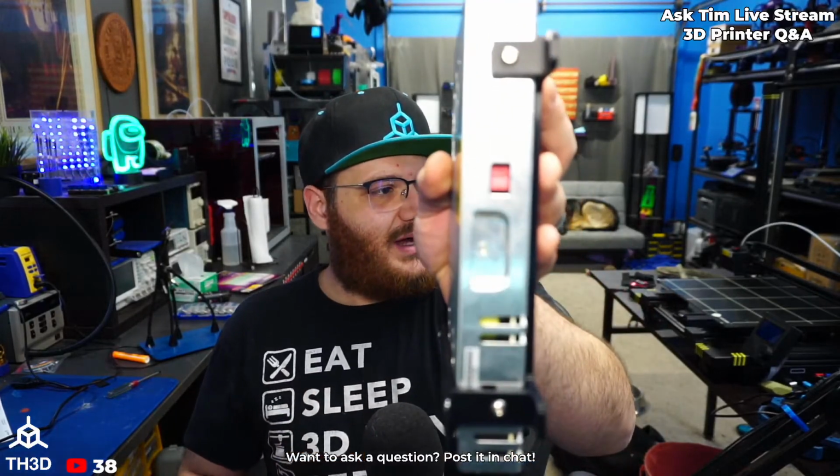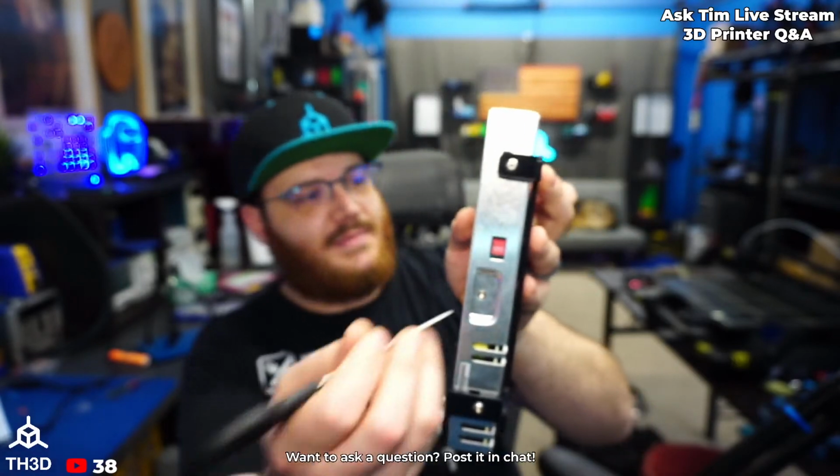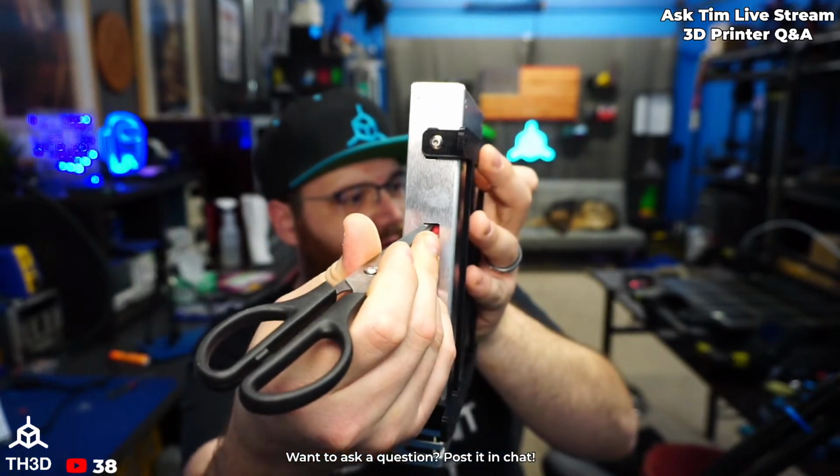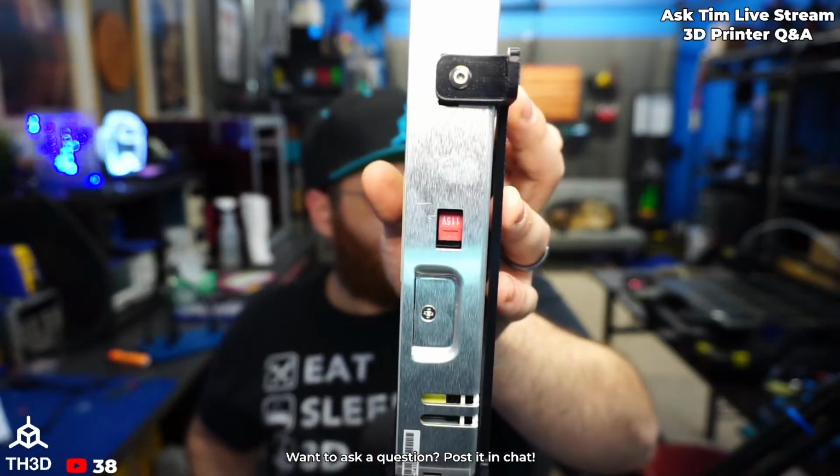There's one other thing, oh yeah, one little quick thing. When you guys make power supply changes, when you get new power supplies, they typically will come set to 230 volts. So you want to just take something and get in there. If you're in the US or Canada, move it down to the 115 position. I'm doing this now because I probably would have put this in the ceiling and wondered why it wasn't working. Because even I overlook that sometimes.